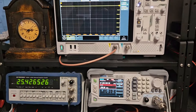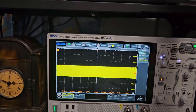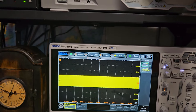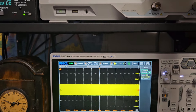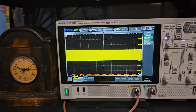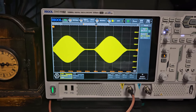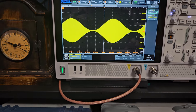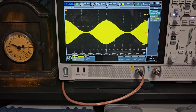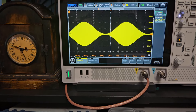On our low RF power setting — all I did was put the limiter in it, I didn't align it. It was in full distortion when I got it. It could still use a little less on the mod, but you can compensate with the mic gain. If I just lower the mic gain back some, you get a nice clean waveform. That's something most wouldn't care about.